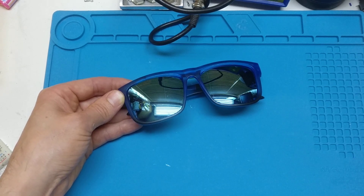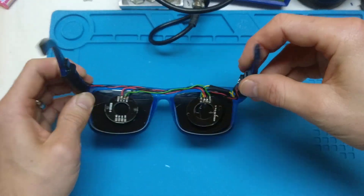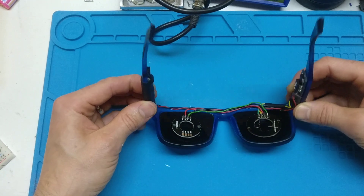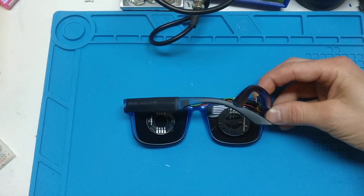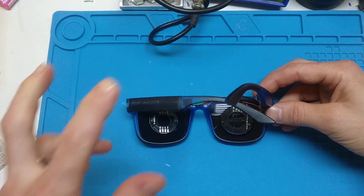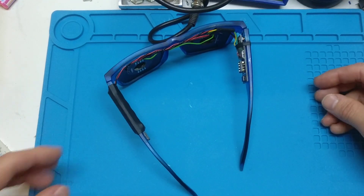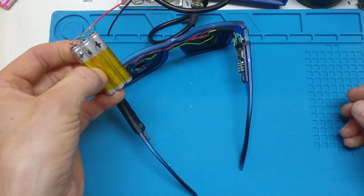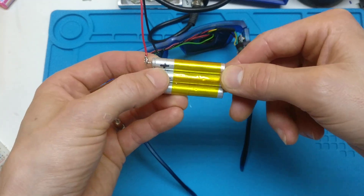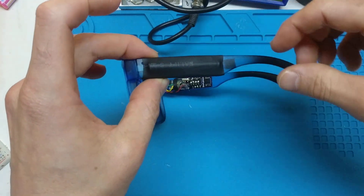There's a few other hurdles in between that taught me a thing or two. This is what I mean when they'd get you arrested going through the airport — imagine taking these off. Probably the main thing I was trying to get sorted with this project was the battery. I remember taking apart a pair of these disposable e-cigs that you get in the shape of a cigarette. They have a quad-A battery — this is three taped together. These batteries are smaller and thinner than a triple-A, so what I did was dremeled out a hole in the side of the arm.